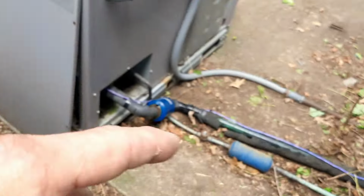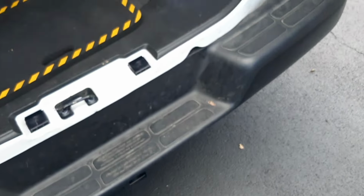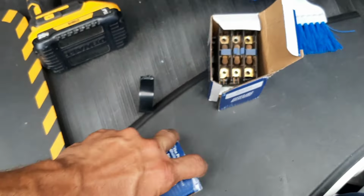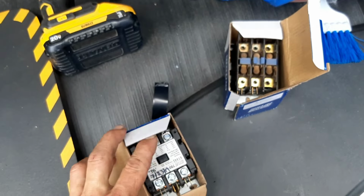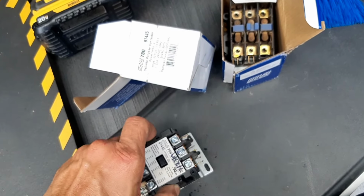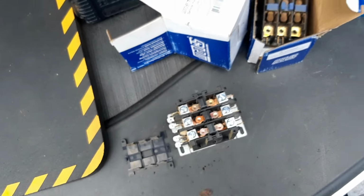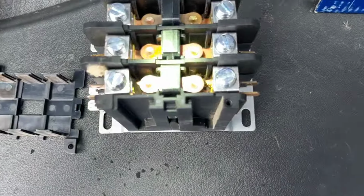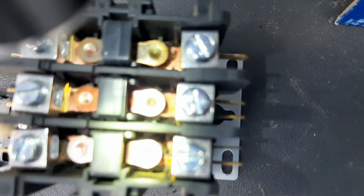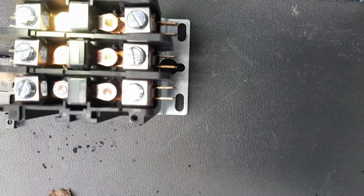I was interrupted. Contactor. We cleaned all the crap up. Our maintenance guy was out here kind of helping me. We're going to go ahead and clean the coil, but it was single phasing and tripping the breaker from what they said. When I finally got all the information, there are ants all down inside there. It's going to be blurry and y'all can't see. There's ants inside.